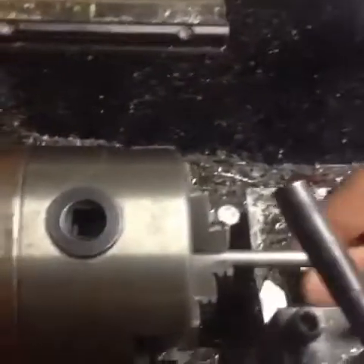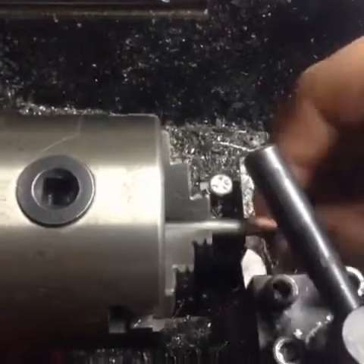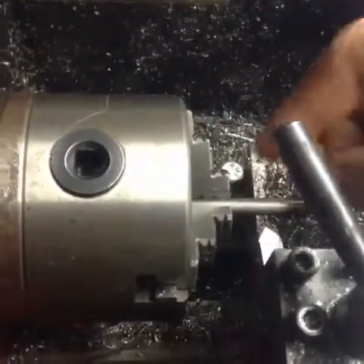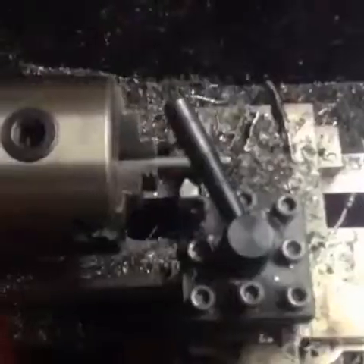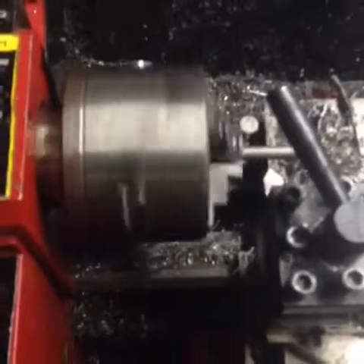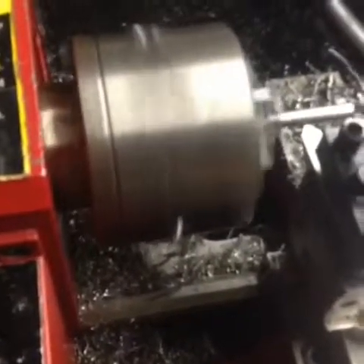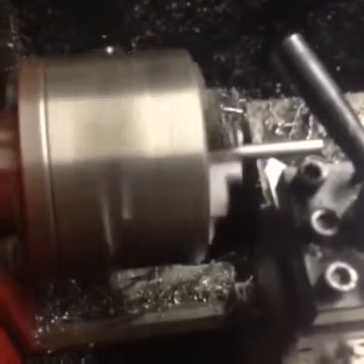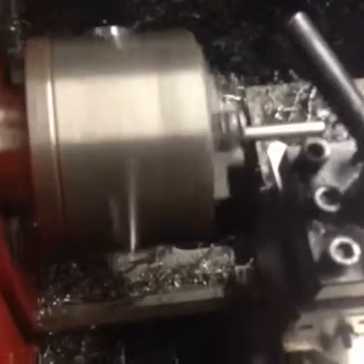All I'm going to do is bring the tool back, lay the bullet up here holding it flush on the end until I get it where I want it, then come in with the tool and draw a line on it. I can go pretty deep but I'm just going to draw a line with the tool as it's spinning. Let me make a couple more double checks. I'm fairly certain that's where I want it, so I'm going to turn it on - you don't need to run it very fast for this. You run in and draw a line, that's all you do.